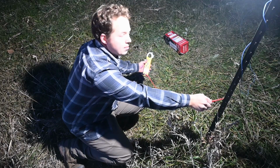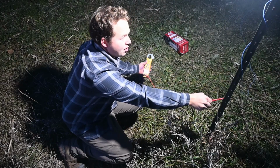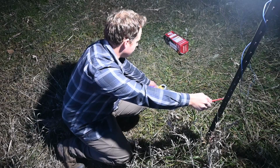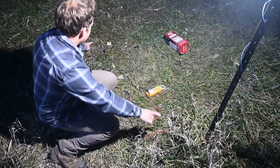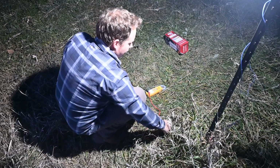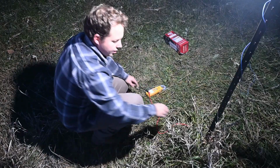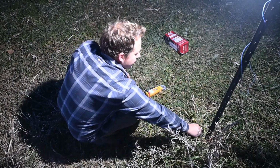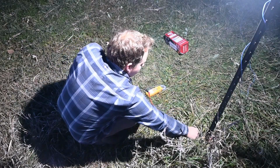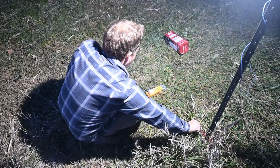So this shouldn't really be a super dangerous amount of electricity. Because we're putting such a small load on it, it isn't creating a huge voltage gradient. Now let's just check in the dirt. Between these 2 points right here, we have 1 volt difference. Now if we move this a little bit closer, now we're at 2.6 volts. Move it a little bit closer yet, kind of right down like an inch away, 3.6, and if we go right next to it, then we're at that 8.8 or 9 volts.